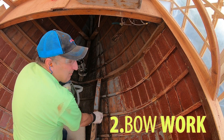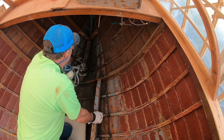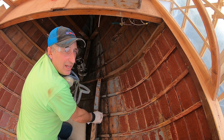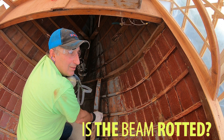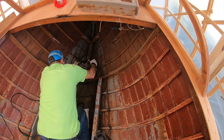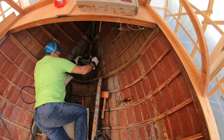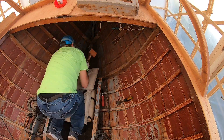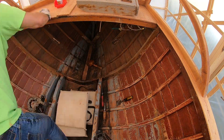This is going to be fun — I'm going to router out the top of this piece and see how bad it actually is. It's going to be a little dusty and miserable under there. It's over 75 degrees in here — the first day I actually had to open the door and leave it open. I'm using the router to remove about three quarters of an inch off the top, cleaning it up with a large slick or chisel afterwards. The beam is mahogany, so it's pretty easy to work with. This removed the rotted area. I'm going to epoxy a new piece on top after I flip the boat over and make sure the other side of the beam isn't rotted.